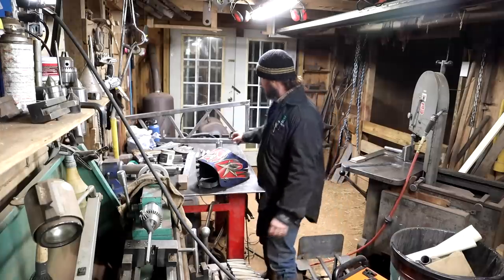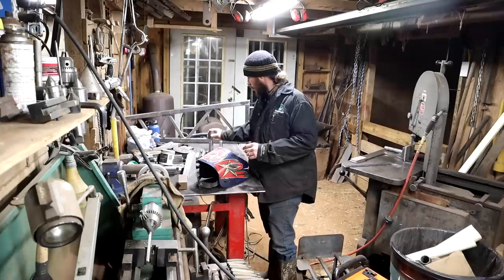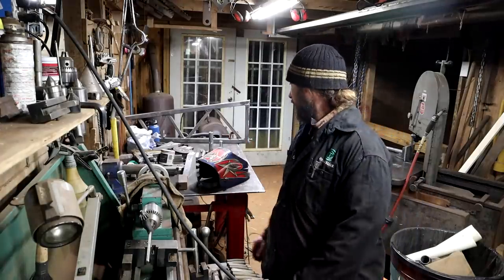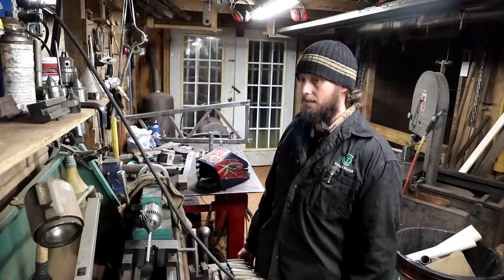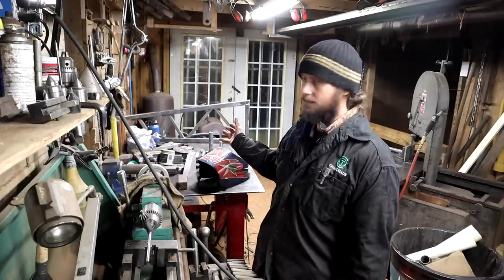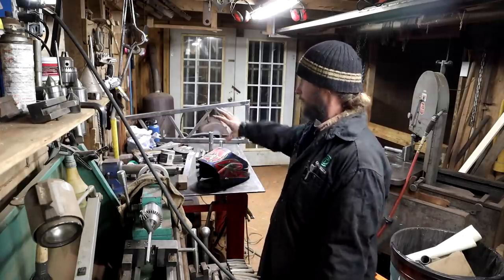The way I wanted to make the hinges was one way, and the way I came up with — we're going to do barrel hinges. That's some one-inch bar; I've got some pipe I'm going to beef up. I really wanted something a little smoother, but for what it is — a one-inch hinge — it's going to hold a bunch of weight. With as much weight as this crane will hold, I mean, that's eighth-inch square tubing, some pretty heavy stuff. I would be more worried about pulling the barn down than breaking any of the metal stuff.